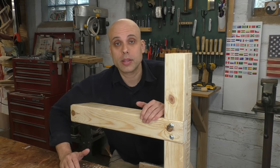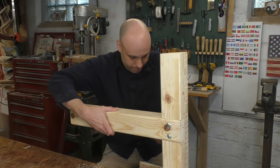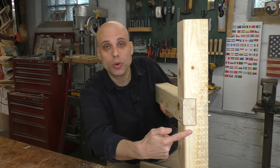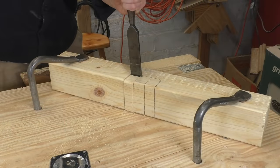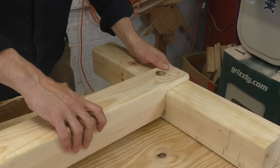And one way we can do that is with this half lap joint. Let me show you what it looks like. It's pretty easy to get the idea. I've just taken out half the wood here and half the wood on this piece and put them together. It wasn't very difficult to make either. It's mostly a couple of saw cuts, you knock out the waste, and then try to get the pieces fitted